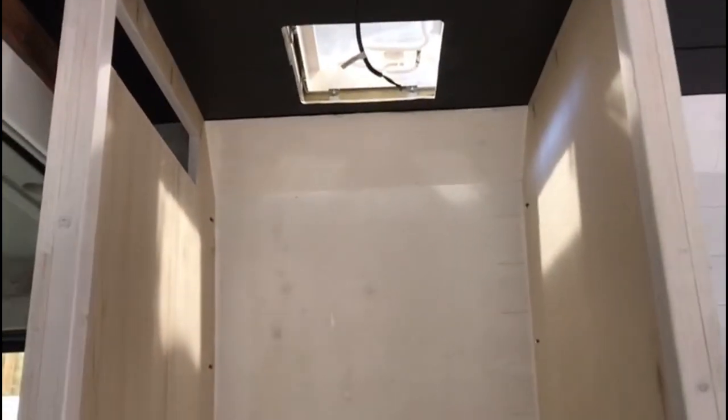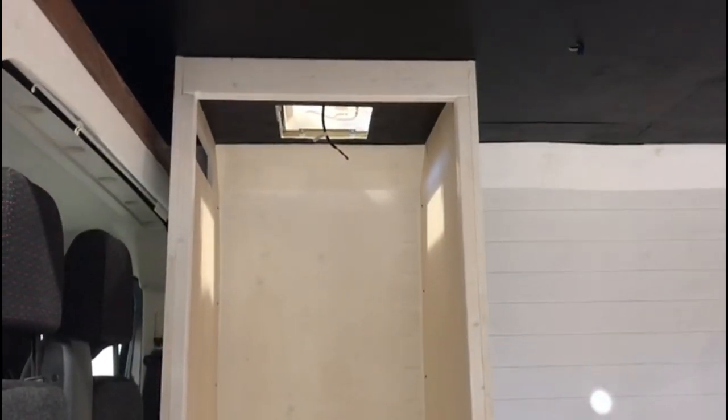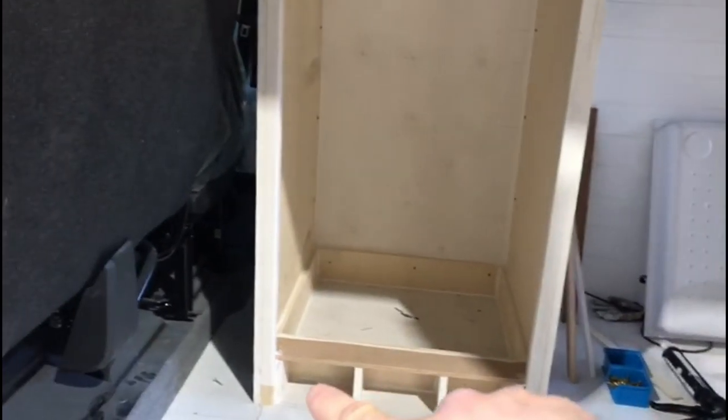I'm just going to talk you through the stage we're at with the shower cubicle. The 18mm walls are fixed at the side wall, the ceiling, and the floor using pocket hole screws — and we've just run a bead of sealant in that corner to seal the corners. To reinforce this 18mm plywood structure, we've created a door lining: at the top there's a piece of 4x2 CLS, then we've ripped down the 4x2 to two 30mm by 38mm vertical pieces screwed to the plywood, which gives structure for the door to sit within.